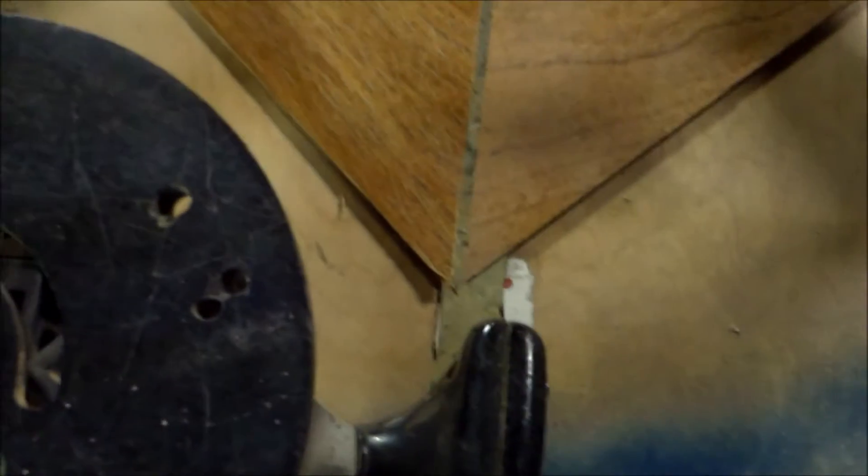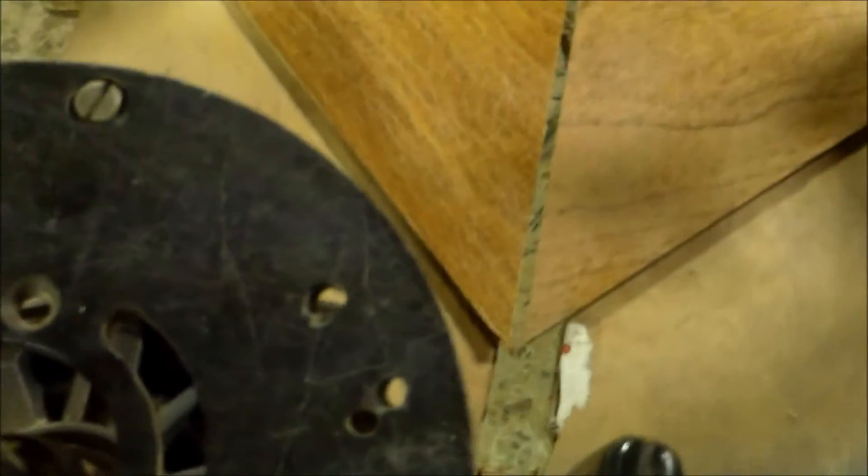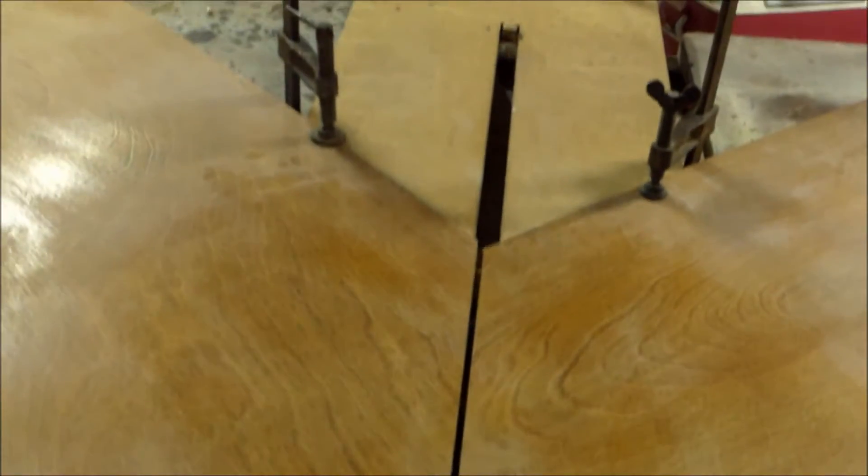Did the same thing as I did with Formica. Left side is hanging over the edge a little bit, and the other side is enough that I'll be able to trim that edge. Now actually, this is just one-eighth plywood I have here — that's all I had to work with. But you can use quarter inch. If you're going to go to anything thicker than quarter inch, rather than a little quarter inch shank router bit, I'd get a half inch shank and a bigger router to do it.